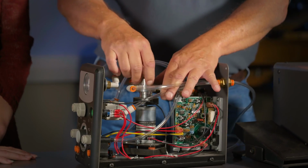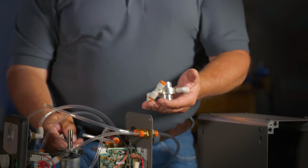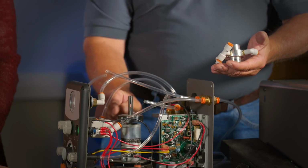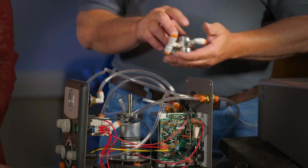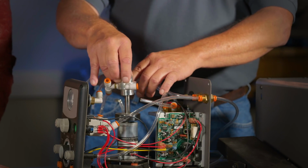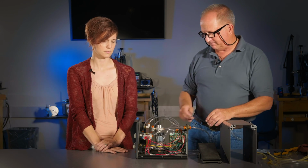You can clean it with alcohol and Q-tips. And while you're in there, clean the rotor. You might have some black marks on it. Just wipe it all down and keep it clean. Keep track of this little nylon washer that's at the bottom there that this rides on against that steel flywheel, but this would be a really good time to clean that.